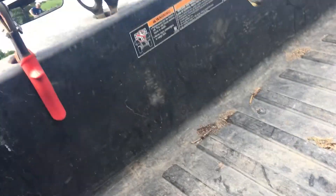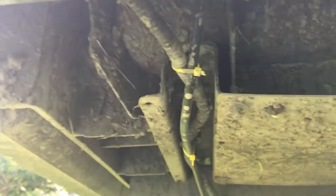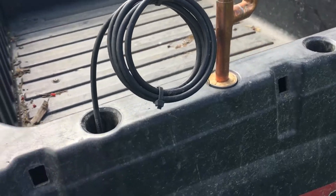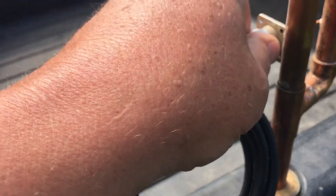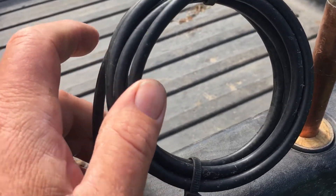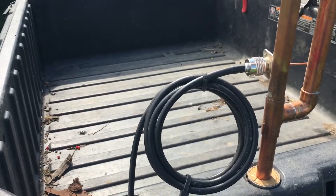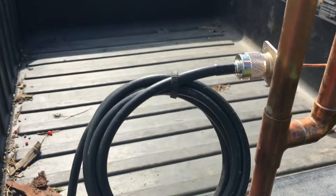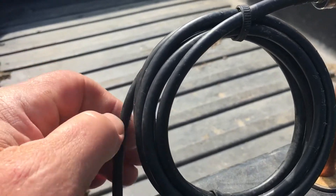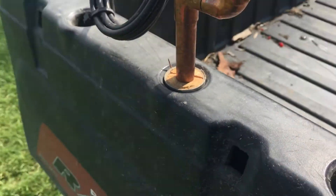The wire comes up through one of the holes here, close to where the hinge is so that it's not moving too much. I wrapped a coil here — this is called a choke. What a choke is for is if you get reflective energy back from the antenna, it could do damage to the radio and cause interference. If you put five windings of a four-inch coil, that's supposed to help prevent that flow-back of electricity.